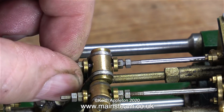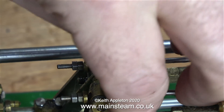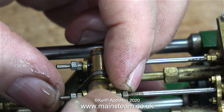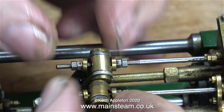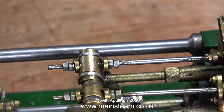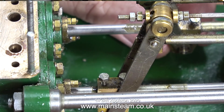I'm really not going to move into obsessive mode at this moment in time — I'll save that for when I've got the water chest back together and it's connected to a water supply, so then I'll be able to put the engine under load and see how it performs. All I'm doing at the moment is just playing with it for the purposes of the tutorial. The man who built this engine, the late Bernard Walker, was a very good engineer, so I would think that the valve timing inside the steam chest is probably okay, and with a bit of luck the threaded parts of the valve spindles should be about the same at both ends when the setting is perfect.